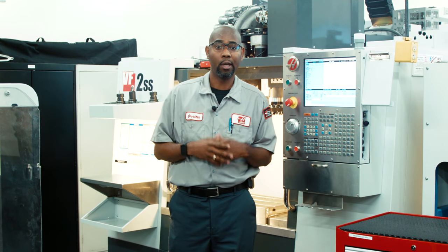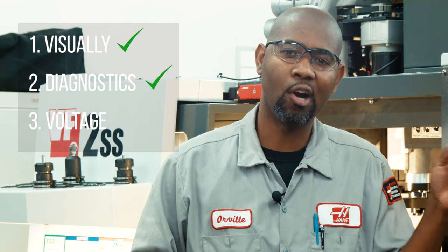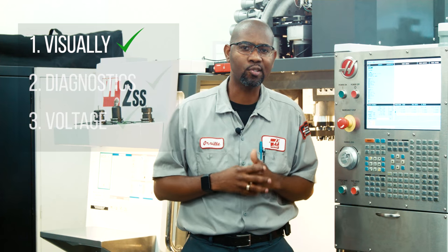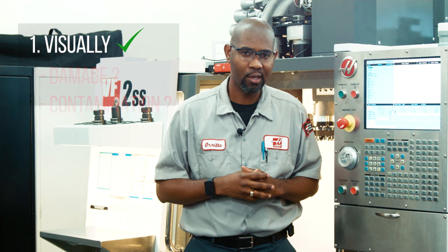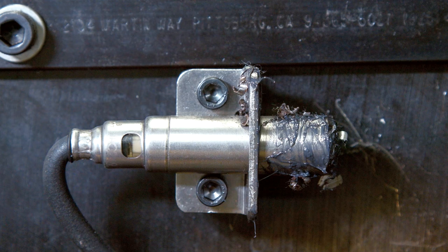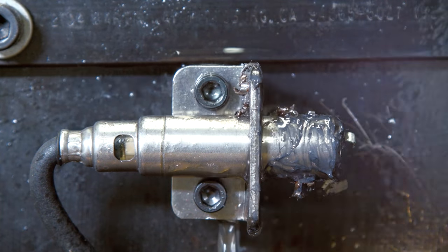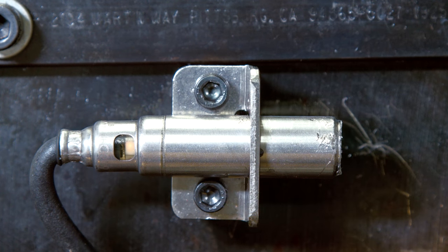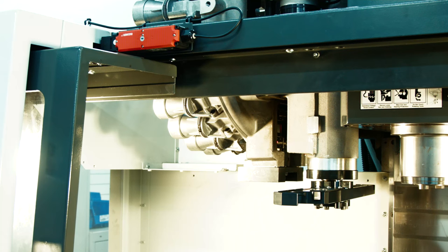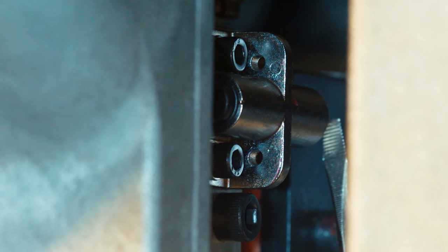We found our sensor, and we're going to check it three ways: first visually, then the on-screen diagnostics, and third, we'll check the voltage. Let's start with the visual check of the sensor. Is there any obvious damage or contamination on the sensor? Are there any metal chips sticking to the face or the body of the sensor? Clean them off — those chips can cause sensor reading errors. Grab a small screwdriver and move it close to the face of the sensor, and check if that sensor light comes on or goes out.